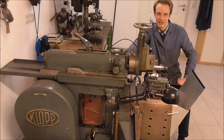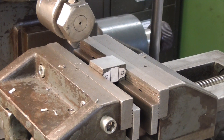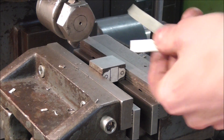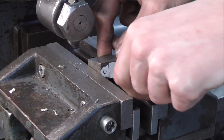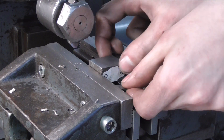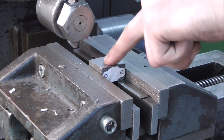That was 190 strokes a minute. Having done the math, I turned the vise over by one degree, and for the upward part of the compound angle I'm going to use half millimeter shim stock under each side just under the tip, so the part will hopefully be half a millimeter taller on this side than on the other end.